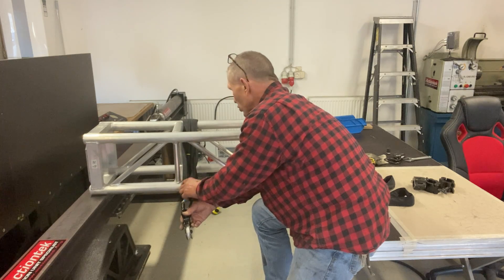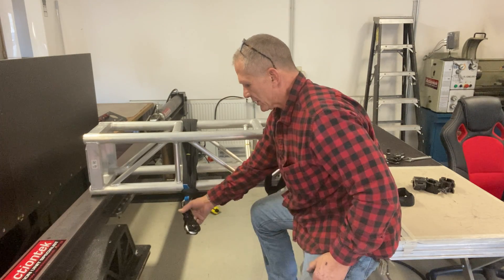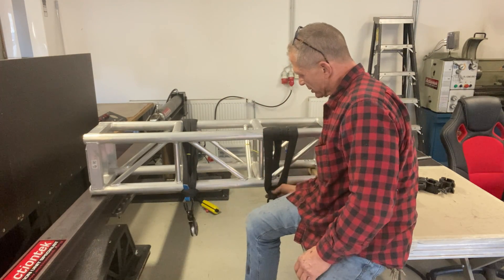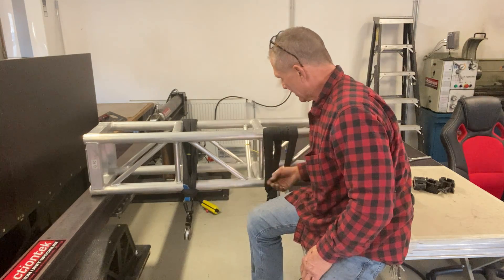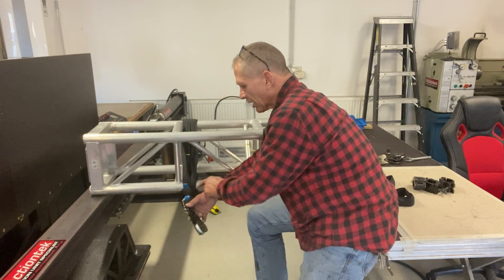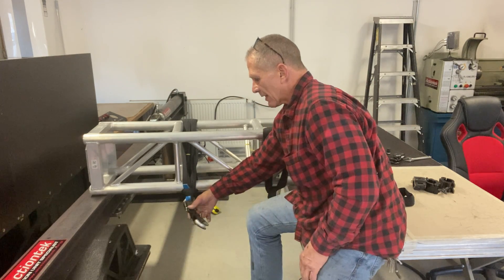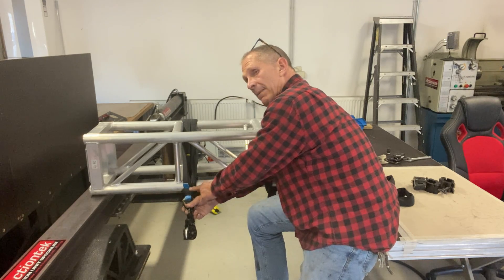So back choked, force in this direction. If you look at this on the other side, you'd see the cross of the span set in the direction of pull. You're always pulling back across the choke. That lets you know. So whatever direction your force is going to go in, that's where you should see that back choke. It's an easy way to check to make sure you've done it the right way.